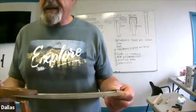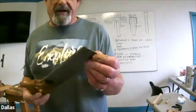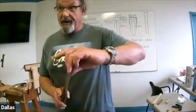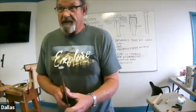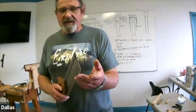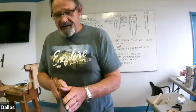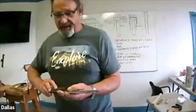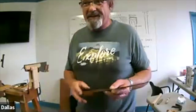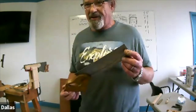I've done several sharpenings just using my home vise — you don't need a saw vise, you just have to be a little creative. But if you see a saw vise on eBay for 25 dollars with five dollar shipping, get it. This other old saw I found in a drawer in the shop — the blade is pretty straight but the teeth were in terrible shape, some completely missing. I did a partial job on it; the teeth are pretty variable. This is not master craftsman work — but over several sharpenings I'll work to get the teeth back consistently.